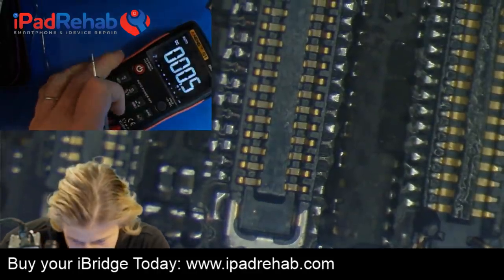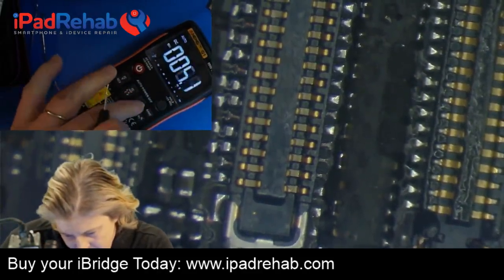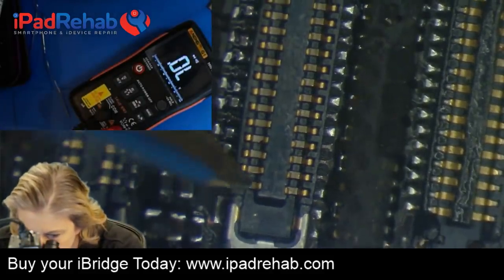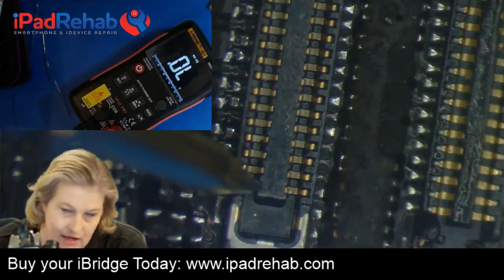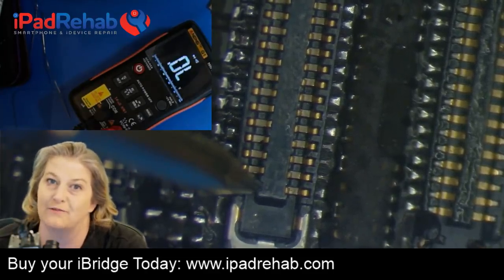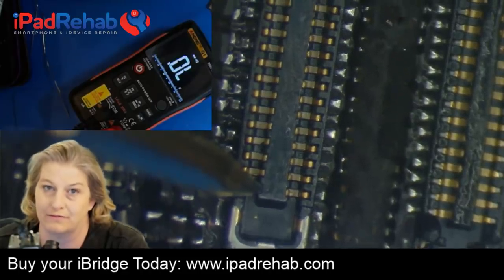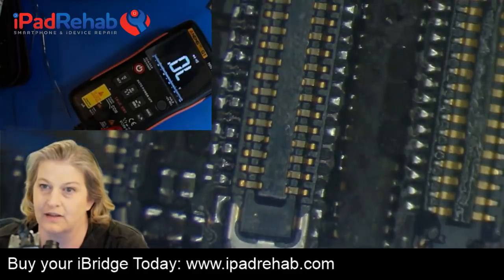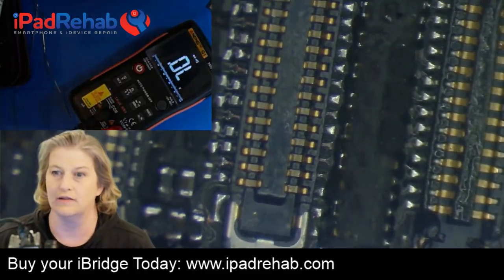All right, let's go to diode mode. Diode mode. All right, red probe on ground. All right, pin 29 is OL. Look at that. It's OL instead of our normal diode mode reading of 0.310. So let's follow that back to the actual filter. So where is that filter?